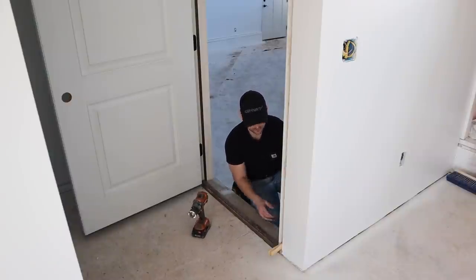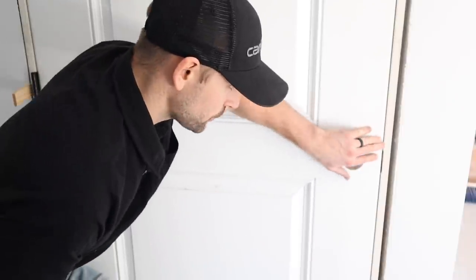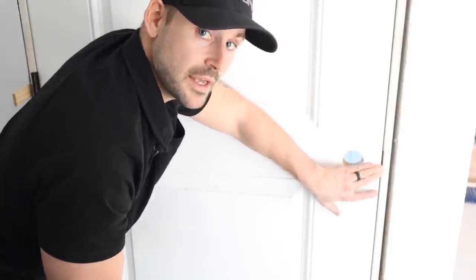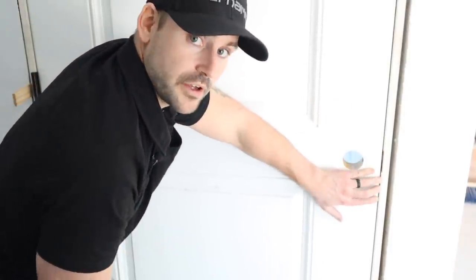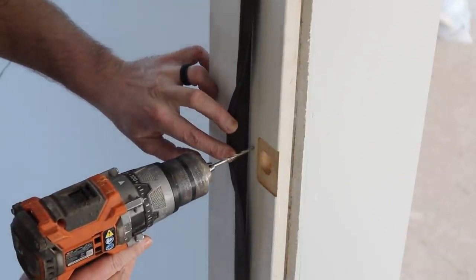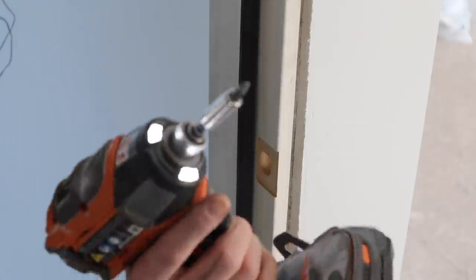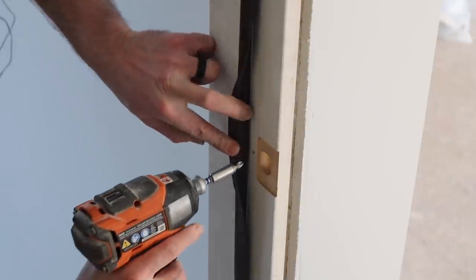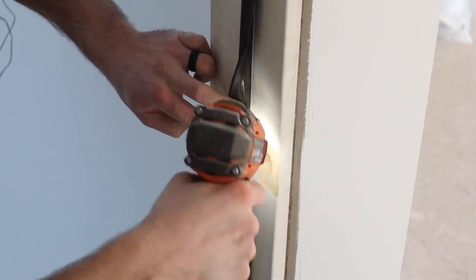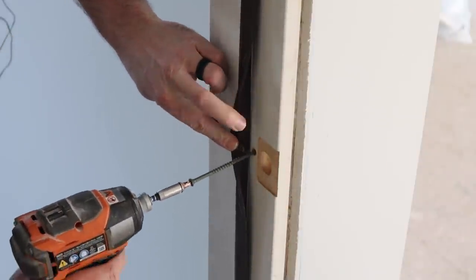The last screw location is where the door latch will be — putting a screw there adds extra security. Shutting the door shows the frame needs to come out a bit, so driving a screw there will draw it out and make the reveal look right. Pull back the weather stripping to hide the screw. Drill out a hole beside where the door latch goes, then use a number-two bit or countersink with your impact driver to give the screw head a place to countersink — a poor man's countersink. Then drive the decking screw right through the door frame.